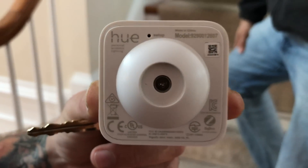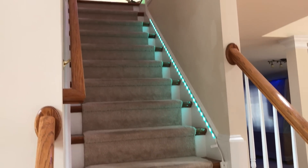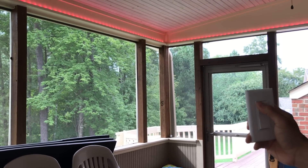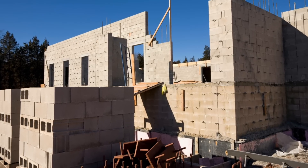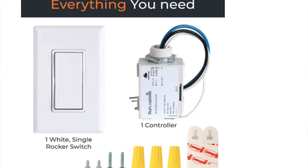Harrison really recommends a sensible approach of making the product match your needs. For instance, he's a really big fan of these Philips sensors, especially around stairs — when you pass by them, they light up the staircase instantly, and a couple minutes after you're gone, they turn the lights off. No hassle — it keeps you safe, and you can essentially rig a whole house this way if you like. The kinetic switch was a good fit for this strip lighting because they could just plug the lights into an existing outlet. The switch and the lights could communicate through a bridge, and there was no need to wire in another switch. These things are also very helpful in places where running more wiring is either too difficult or unsightly — places with concrete walls, for instance. You can literally just stick this unit to the wall, pair it with a smart light or a light with a smart control, and you've got yourself a light switch.